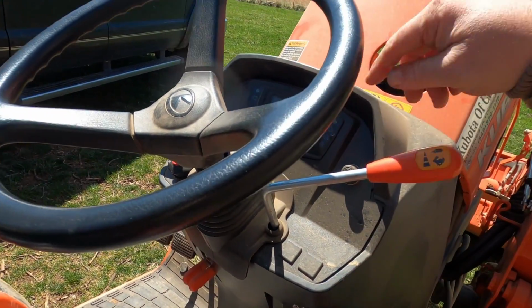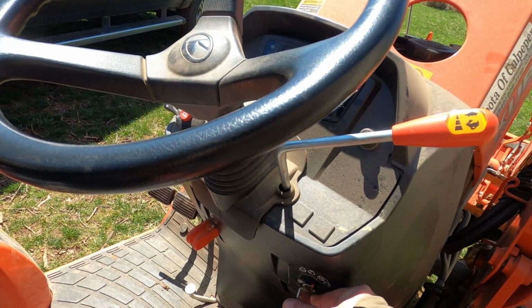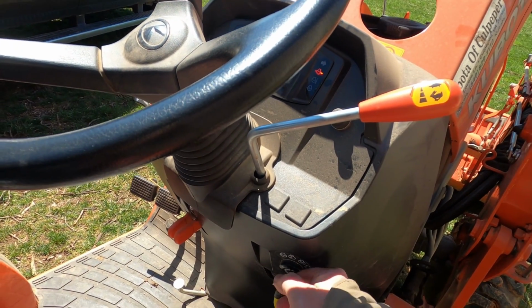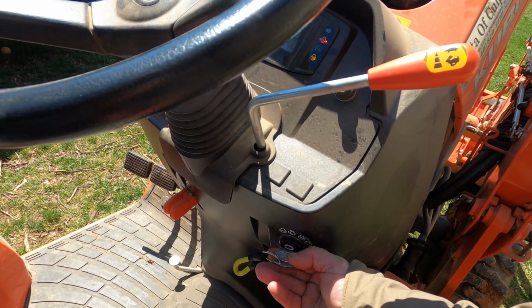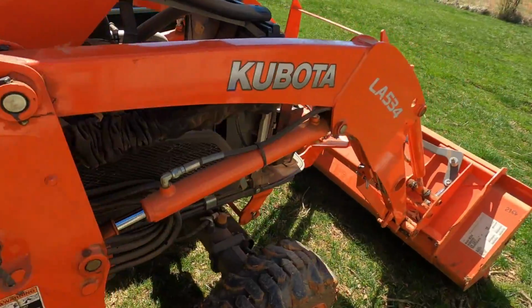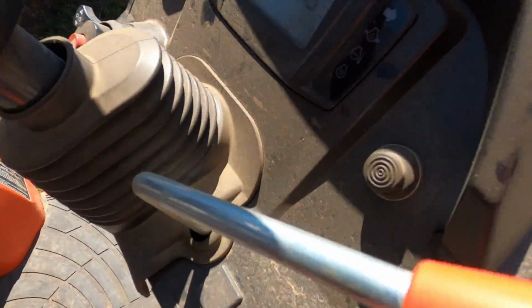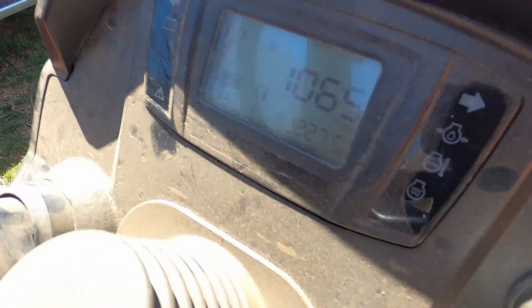Anyway, last time I did this, the oil light come on for a second. And we'll start her up. Everything's sealed, we know that. Starts right up. No smoke. If it starts smoking, that's a sign that you've overfilled it. But it looks good. No lights on the dash.